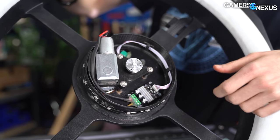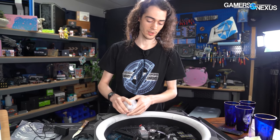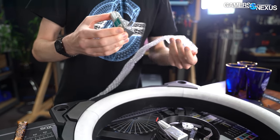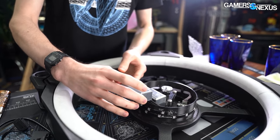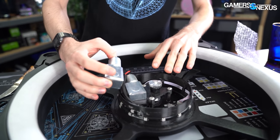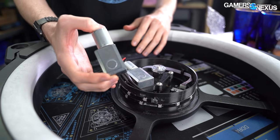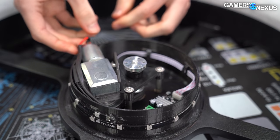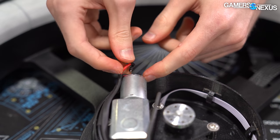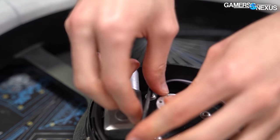Hopefully that was the problem, because we are going to put exactly the same motor and gearbox back in. We looked up the QR code on here and went to the website and bought what should be exactly the same motor and gearbox assembly - just an off-the-shelf part. Unless something was epoxied together permanently, we should just be able to disassemble this and drop in the new part. I should also note that I caused some damage after the fact - these tabs had gotten brittle and I broke one of them off, but that's not the reason it stopped running.